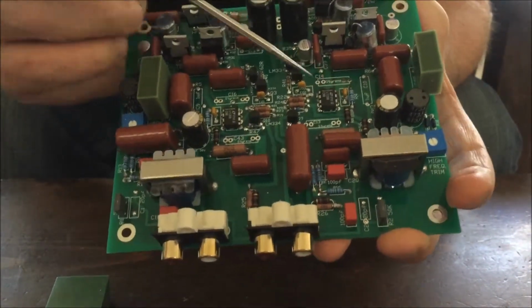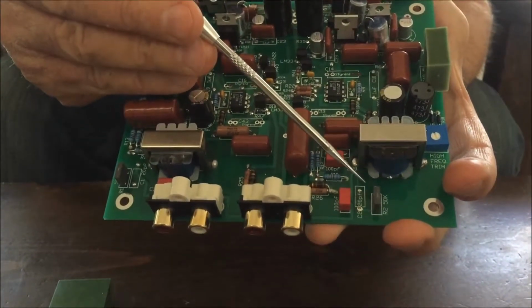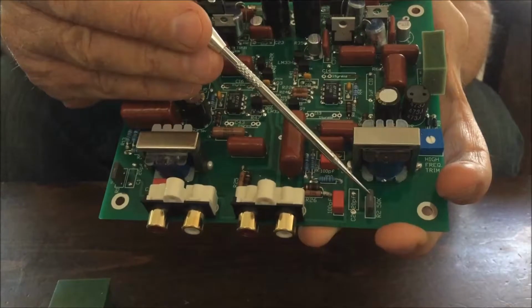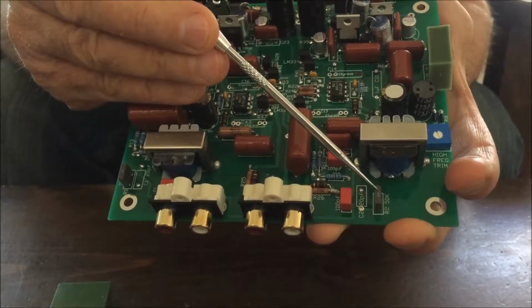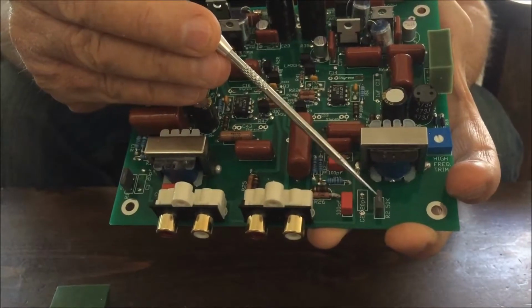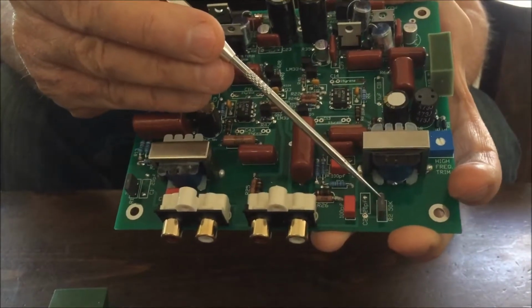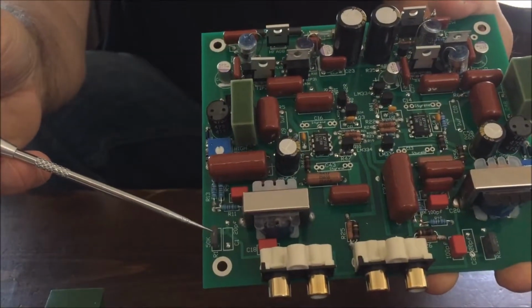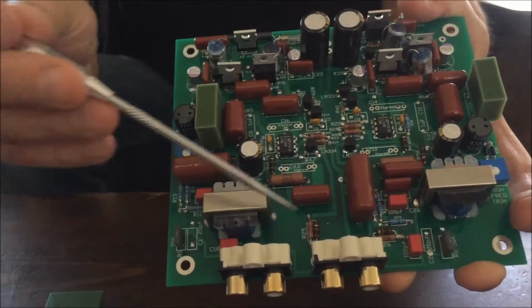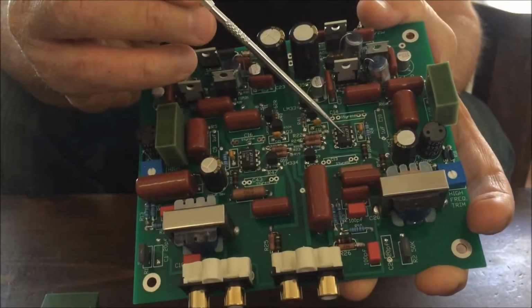Also, what is very important is our Cadock resistors. This is the first component that your cartridge sees when you send the signal from your turntable to the LCR Mark III. These are your cartridge loading resistors. These are Cadock bulk foil resistors. We have one here and we have one here. And then all these things gather around to go to the op amp.